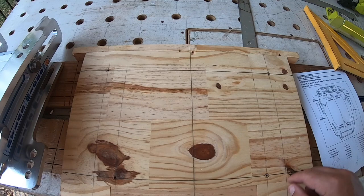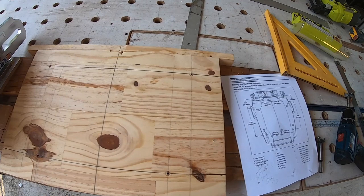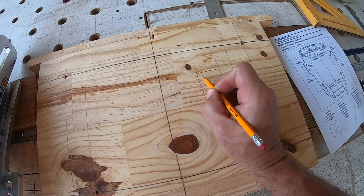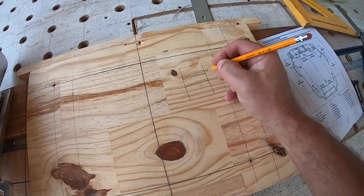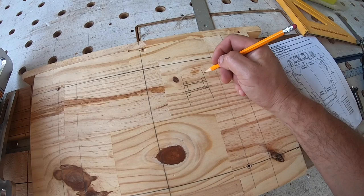So then I took this, and I'll go show you, I put it on the transom of the boat and drilled these pilot holes. So what I'm trying to do here, this will be a good description, is if this is the transom, and I drill a hole straight through it, like to put the bolts in it, what I want to do is over drill it, and then also put caps on the ends, so that whole bolt will be encapsulated in epoxy. So there'll be no way for any water migration to go this way.